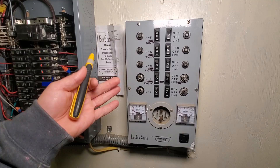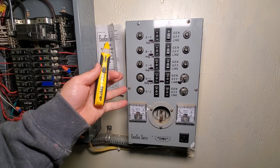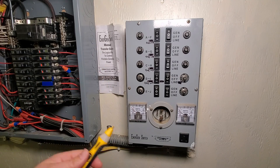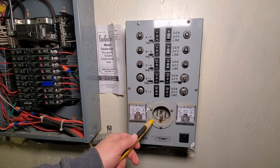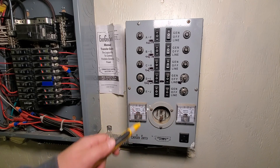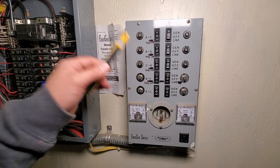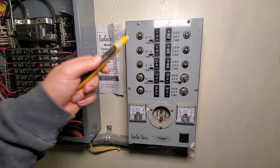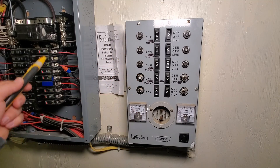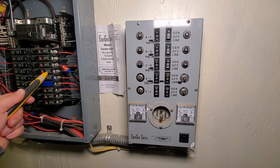This box itself is kind of similar to a panel, except it's a smaller scale. We have our main power supply — in this case it's a 30 amp 240 volt inlet — and those circuits are obviously not 30 amp circuits. So we have to then protect the wiring for each one of those circuits again. Even though there are circuit breakers over here for them, when we put this into bypass mode it's not using those circuit breakers anymore.